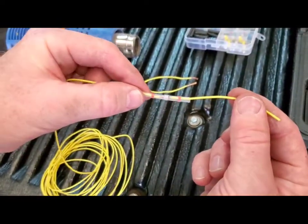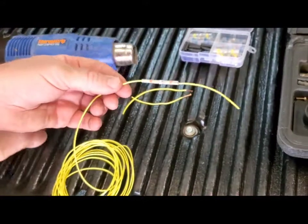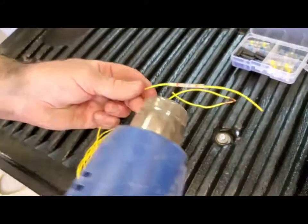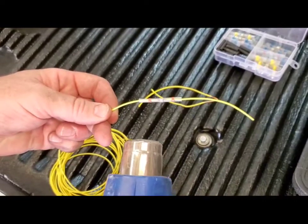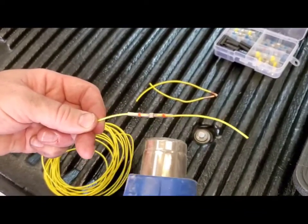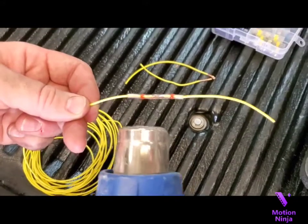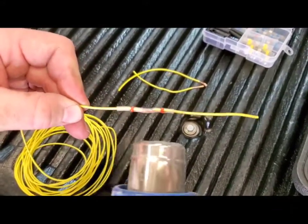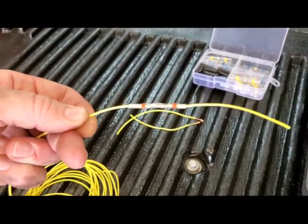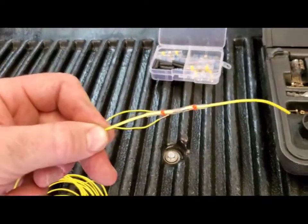Slide the connector over the top, dead center — you want the solder to be dead center of the wire. Now we're going to shrink it. With the heat gun on the high setting, start on the heat shrink and watch how it starts to suck in — nice and tight. Work back and forth a little bit so it gets in there evenly. Now watch how the solder just starts to melt — there it goes, see how it's melting. Rotate a little bit to get that solder all the way around. Now it's all done — the solder is all the way around your wires, fully connected, with a nice protective heat shrink on there.